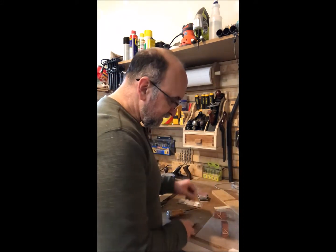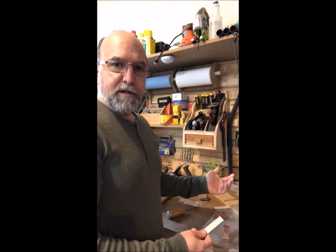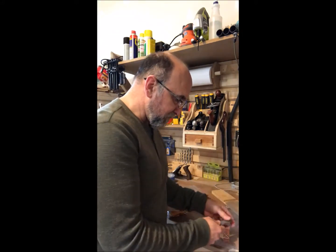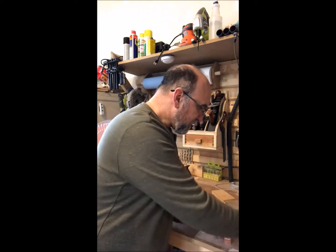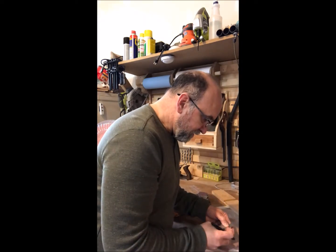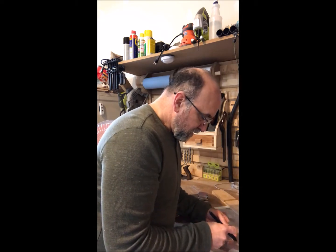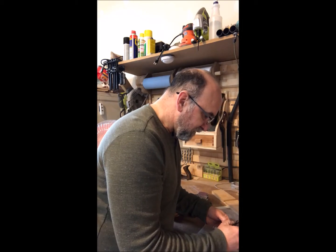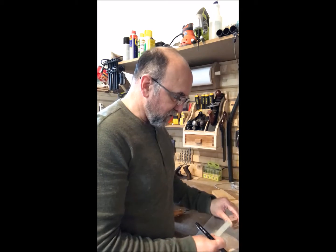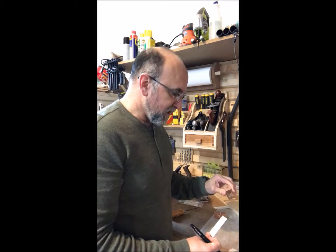I have done that already. The next thing, once you've got it cut down into the two halves, again, assuming that you're doing a pen with two halves, like a trim line, then you just put your cross to find your center point. And I always double check this because, for the same reason with a Celtic knot pen, it's more critical than with other pens to make sure that your tube is drilled exactly in the center of the wood.